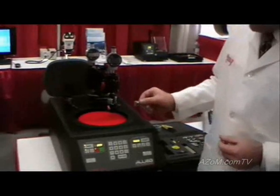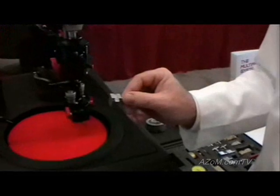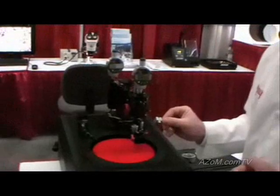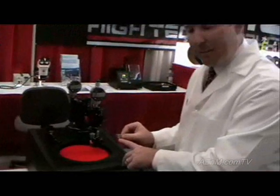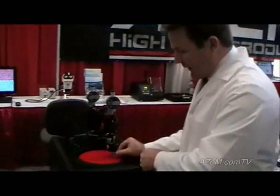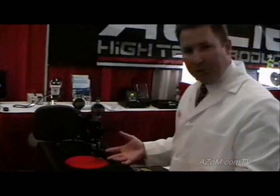The sample is mounted to a fixture and there are many different types of fixtures for adjusting the orientation of a sample. In this case, this would be a cross-sectioning fixture. This particular one features a Pyrex insert, which is useful for TEM sample preparation. The fixture is secured mechanically with a cam lock operating tool-free, which allows you not to have to look for Allen wrenches or screwdrivers.